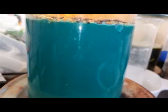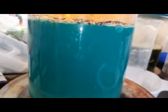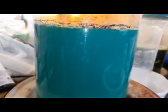You can see the gold, nice bits of gold there, and you can see the gold flying around in there, and there's sediment down the bottom, and I'm just cooking it until there's no reaction. I'll add to it over time. And when there's a lot in there, last time I had at least that thick of sediment of all the solution, the boards, plugs, bits of plastic, and then I tipped it all into my aqua regia after I drained all the nitric acid off. The nitric acid, if there's any spare nitric in there, it doesn't go to waste. That can be used for silver or other nitric baths like this.